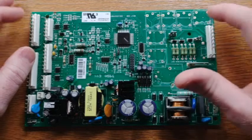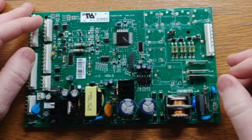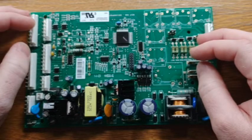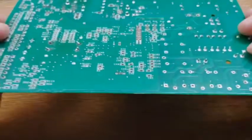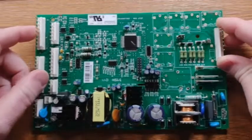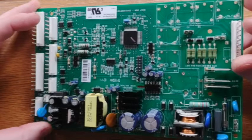Typical symptoms for a failed control board will be clicking relays, a burned solder joint on the back side of that L-shaped one, bulging capacitors like we talked about, or the brown or black resistors. Let me show you how it's done. Quick disclaimer: I'm not responsible for any damage to your board, yourself, your property, or anybody else's property. You should be responsible for your own actions, just as we all should be. Thanks for watching, let's get going.